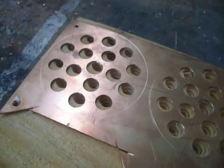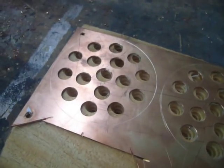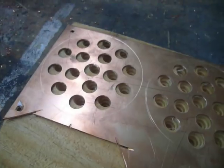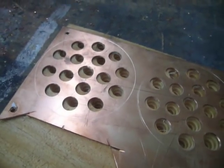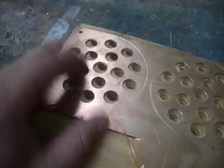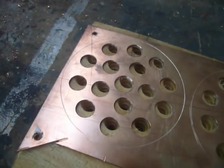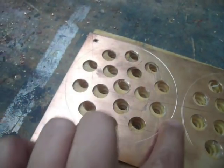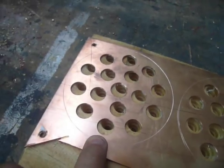These are the 4-inch copper baffles for the stainless condenser jacket I'm building — my product condenser for my large still. They've been laid out exactly the same as the 2-inch baffles I made in my 2-inch combo still video. I've just peeled the paper off them. You can see I've scribed out the circumference for the inside of the stainless steel ferrule — it's about 98 millimetres.